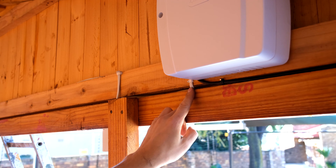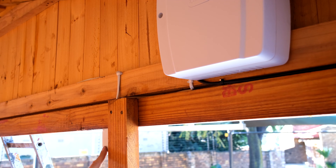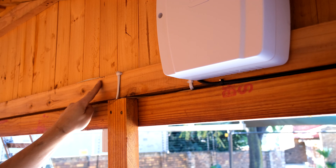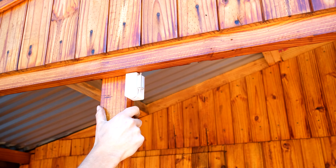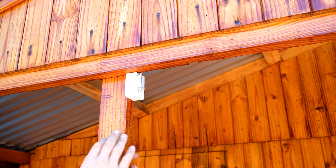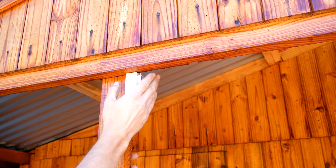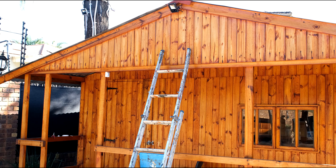Coming out the side is the load wire going first to the day-night switch — it comes into this box, then from the output of the day-night switch it feeds my light. Here's the day-night switch mounted on the side. I need it on the outside; if you mount it too far inside it activates the light too early before it's properly dark. There you can see the light mounted at the top — when I cover the day-night switch, the light goes on and off. So there you see the completed installation: when it gets dark the floodlight comes on, and if the mains fails it will remain on for however many hours until the battery discharges. Thanks for watching and cheers!